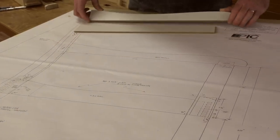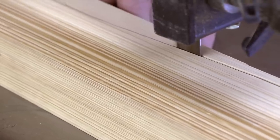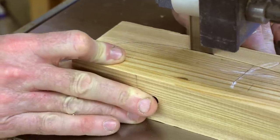With all the mortise and tenon joinery finished, I drew some templates from the drawing so I could trace the curves of the seat rails and arms, and finally got to cutting these shapes out on the bandsaw, cutting straight to the lines.